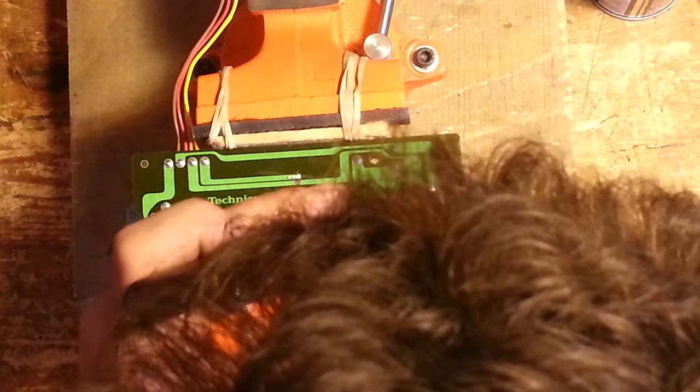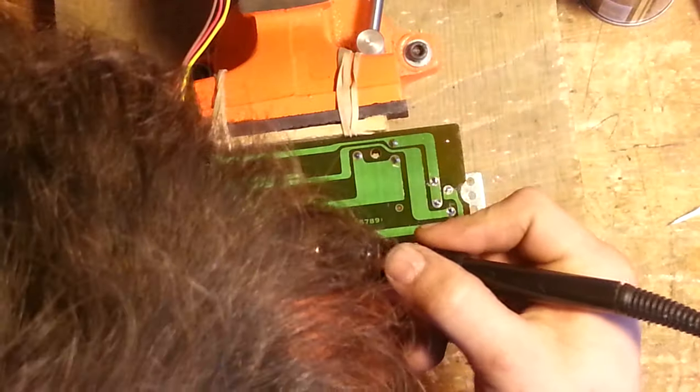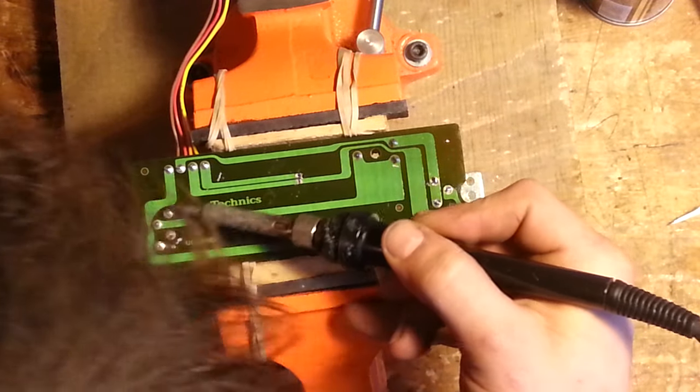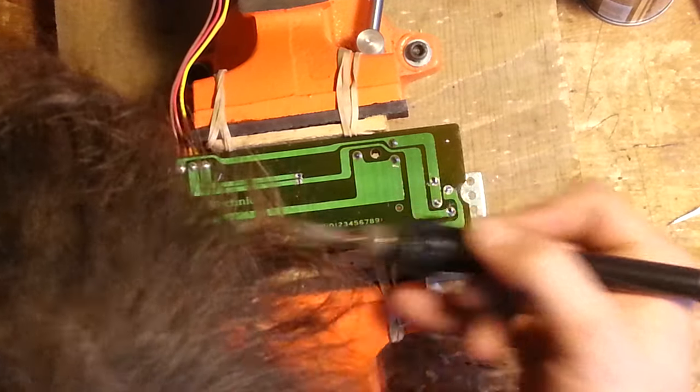So I'm going to start by pulling this off — we're going to desolder all this stuff. Sometimes you need to hit it a couple of times with the desoldering tool to make sure you get all the solder out of the hole so the fader will drop out easily. You don't want to tug it out because you can damage a trace on the board and then you'd have to make jumpers and do circuit board work, which is not desirable. Also, Technics bends the pins over to lock things in before soldering, so you have to bend those back before pulling it out.